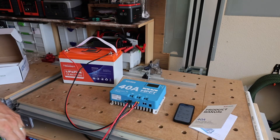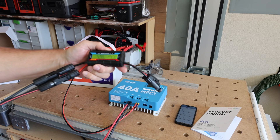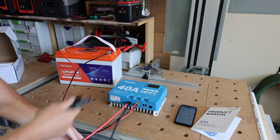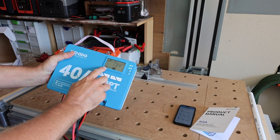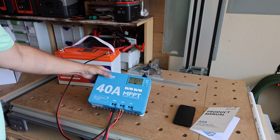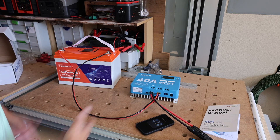I've got a 400 watt solar panel. It won't quite hit 40 amps, but I want to test the efficiency. My meter is showing the panel is pushing out 42.7 volts before hookup. Let's connect it and see how quickly it recognizes the panel. There we go — we've got the solar panel icon and it is charging into the battery. The app is showing 33.7 volts; the meter shows 33.6 volts — very close. The battery is at 100%, so I'll hook up my inverter, discharge it, and then test efficiency.